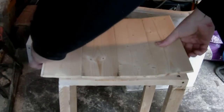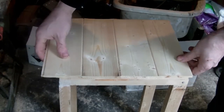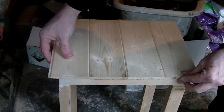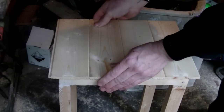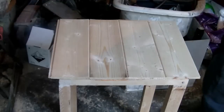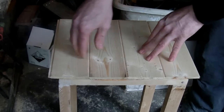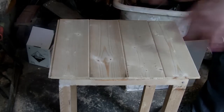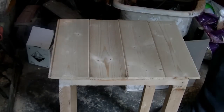It's wood, remember. Now what I'm going to do is take these and slightly overdo it and then trim off. Because I've got a router, I can trim off the excess using the router. And so then I get something like that. That's all I've got to do. So just nail them in, router around, done.